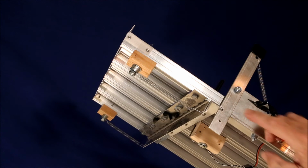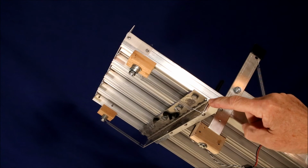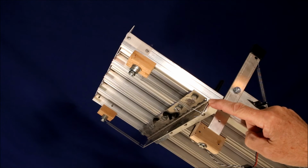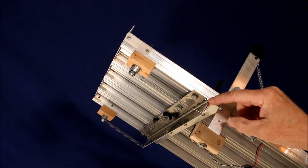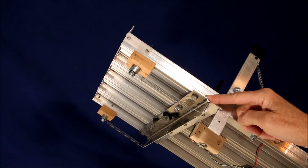The first motion moves the track downward away from the car, making the front end light. The return stroke slams into the front wheels of the car, sending them into the air and creating the erratic starts that many of these tracks experience. The first improvement I made was to work the piano hinge back and forth and wiggle it side to side and add a lot of lubricant so that it would hinge more freely.